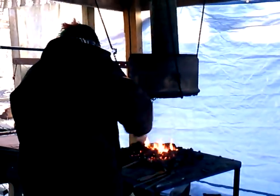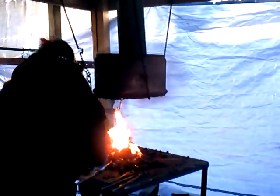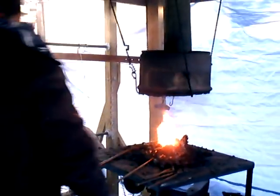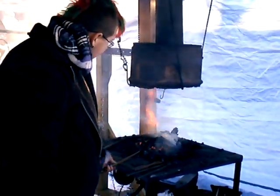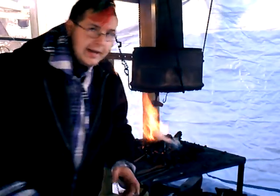Reposition my fire a little bit here. Get some fresh coal in here — add a little bit to the side, not much. Now, you can see when that new coal is added, how much smoke it gives right here. But right here in the middle, it has very little flame — that's what I want to see. So on video number three, we're going to put the hole where it's supposed to be and then form the curve. Make sure you check out video number three. Thanks.